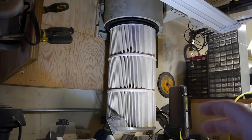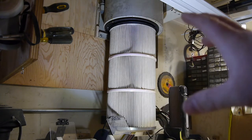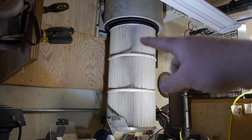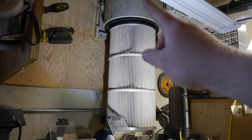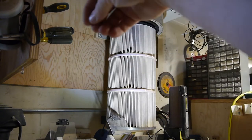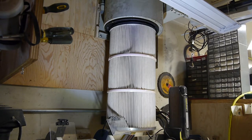Subscriber Luke Dawson asked if I could quickly go over how I made this dust extractor. So this is a house furnace fan. It's essentially a centrifugal blower. Air is drawn in through the filter into the center of this. The fans then whip the air to the outside and eventually up against that wall, and it hits the wall and goes down and out and to the sides.